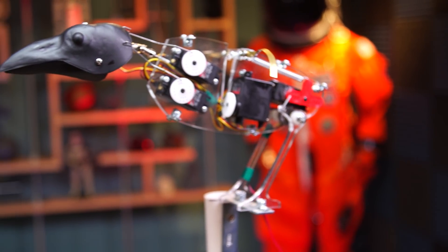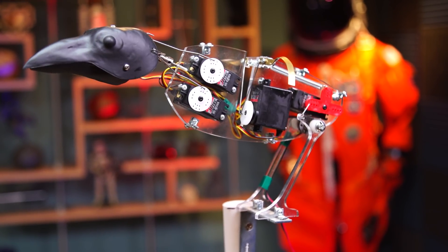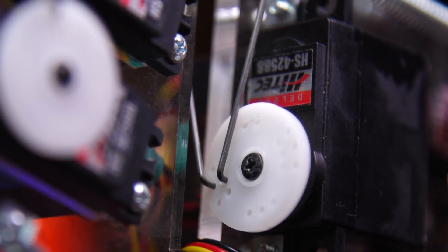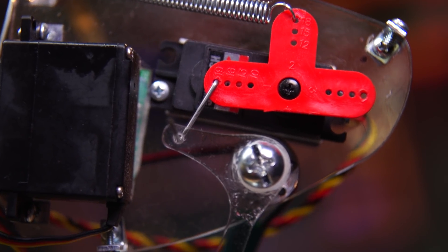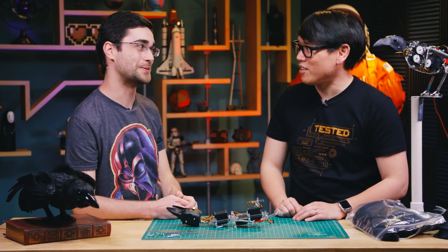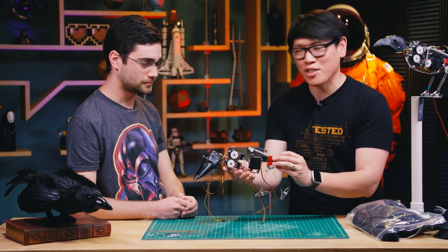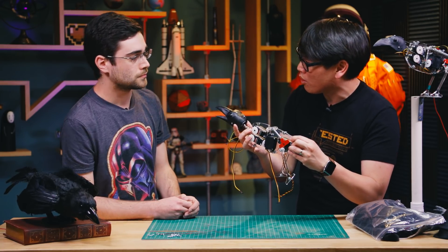The one-off was kind of similar in how the mechanics worked, but there were a lot of 3D-printed parts so I could test and prototype, and a lot of the chassis structure was just hand-cut. But to get it simplified into the kit, I switched over to laser-cut parts and vacuforms for the head and the body. This is all self-made — off-the-shelf servos and a programmable control board, but you're designing the laser-cut parts, doing your own vacuforming, and patterning out the skin and feathering — all done in your apartment. Yeah, it's a tight space, but you can really make anything work if you really want to.